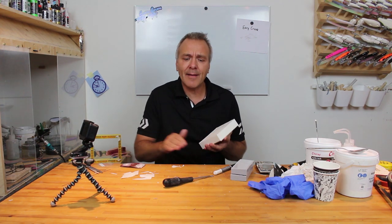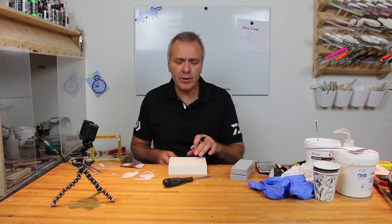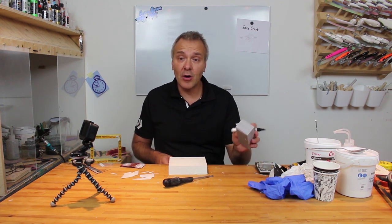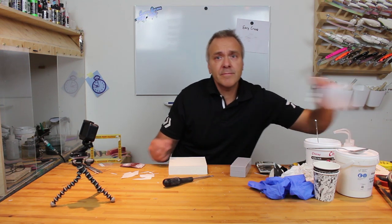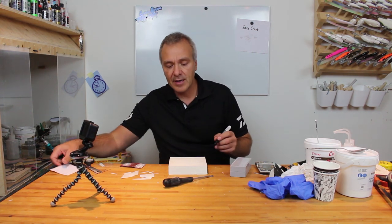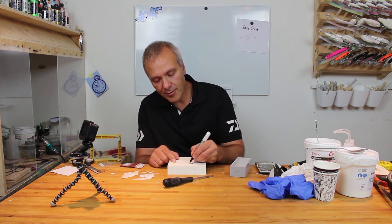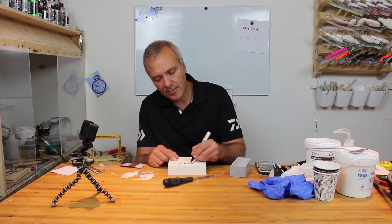This will make it more or less like paper and enable me to write how much silicone is needed to make this mold. And I know that since I've just made the other one, and I know how much I used, so I can easily take my notes from that one, saying just about 150 grams of silicone and 7.5 grams of hardener. And I have to double that up, so it is 300 grams of silicone and 15 grams.